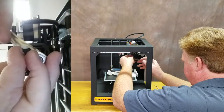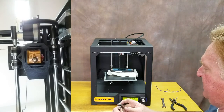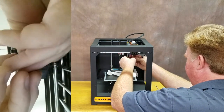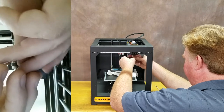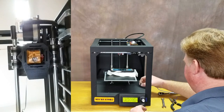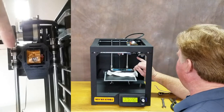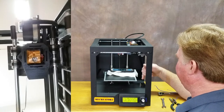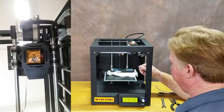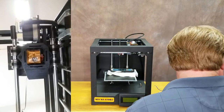I'm going to take the nozzle out using — I believe this is a seven millimeter socket. Just do not touch the nozzle directly because right now it is 180 degrees Celsius, so it will definitely burn. I'm just going to lay that right there for now. Since the Teflon tube didn't come out with the nozzle, I'm pretty sure I'm going to have to pull the nozzle throat out completely. So we're going to go ahead and power off the machine — it makes everything a lot quieter that way.